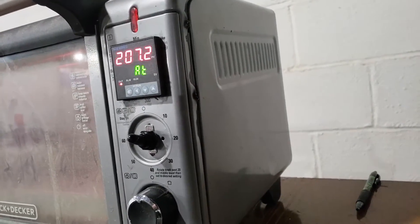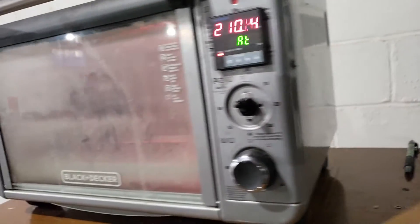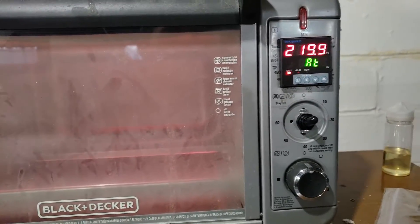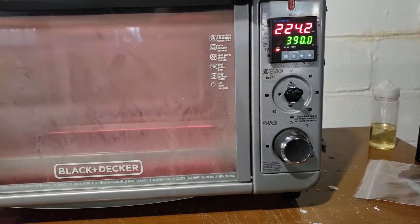I also put one-inch ceramic insulation around the entire oven, including over here in this cavity. I've got the SSR — solid-state relay — mounted on that far wall. It's great insulation because it's room temperature up top, but it's reading 218°F inside, and we'll give it a while and see how that goes.